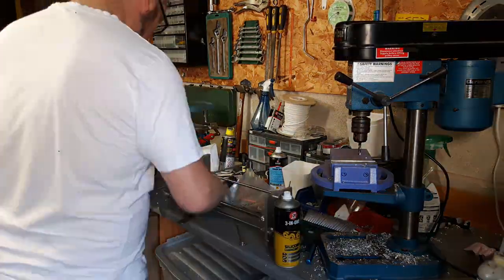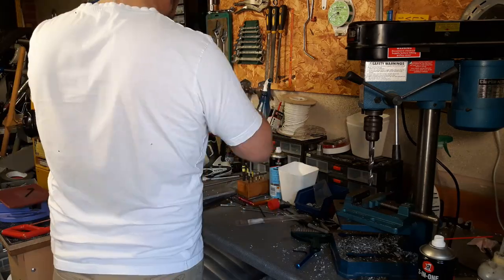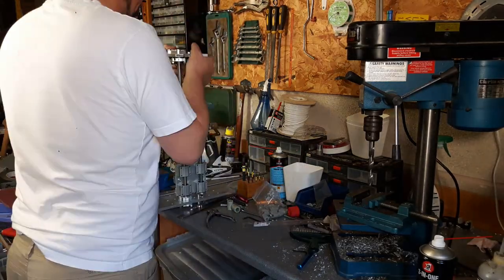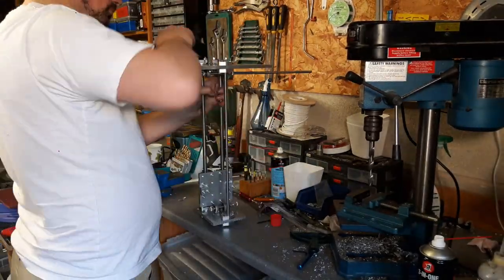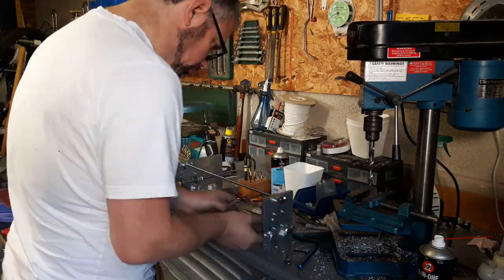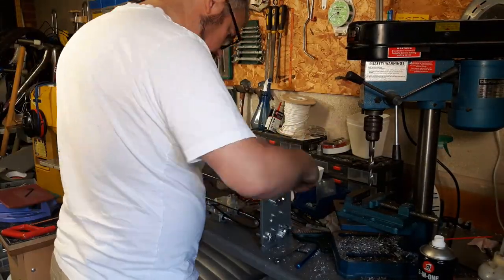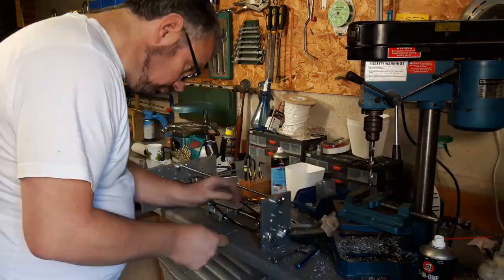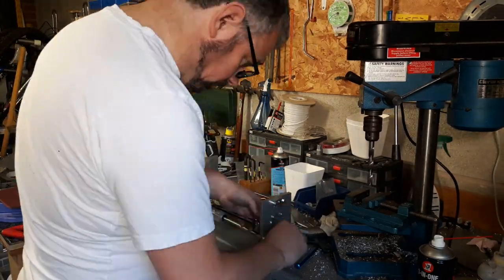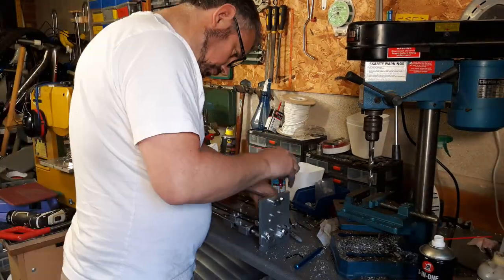Getting all this together, you can see — this is when I was trying to get everything trammed up to get those bearings to slide properly. Eventually I gave up, took the end plate off, and put the original linear bearings back in instead of those bushings, and everything worked really well. A bit annoying — I probably lost 20 minutes mucking about, but you live and learn. Now we're just trying to put these belts on. I've got two belts, one either side, to give a nice clean drive, keep the drive over the top of the bearings, and also keep the centre of that platter free for the print head.